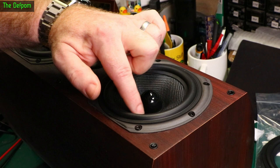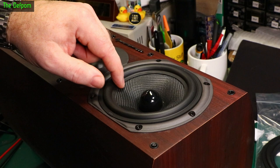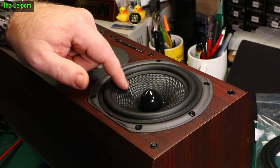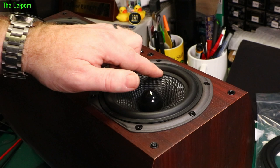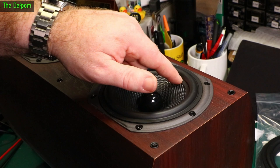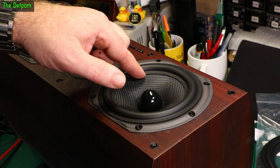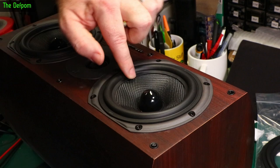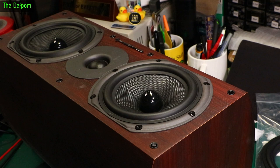And if you ever do find one that was pushed in and damaged, there's a trick to fixing it: get a vacuum cleaner, stick it on the center and the vacuum will pop it back out again. Anyone who's had children will know this one — my children damaged them by pushing the cones in. But the vacuum cleaner pops them straight back out. Okay, that's in there pretty well now. I don't want to take the power off yet because I want it to definitely set up properly. I'm basically just flattening out the glue — I can see some little ripples on this side so I'm trying to concentrate on that. Just trying to flatten the glue out so it's not lumpy. I'll let this cure for a few minutes and come back to do the outside.